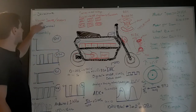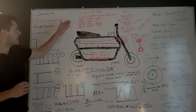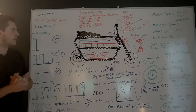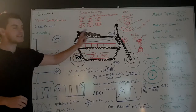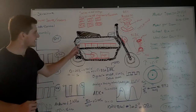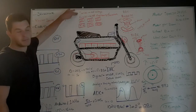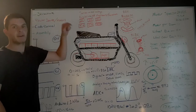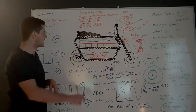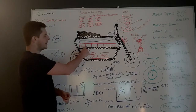Let's move on to the power source and the motors. We did cover this a little bit in previous videos — I walked you through series and parallel and how we set up the batteries to get the voltage we wanted. Just to reiterate: the motors we used were 24 volts, which means they need a 24-volt power supply to run at their full potential. I had six 12-volt batteries. If you connect batteries in series, that means you do plus to minus, plus to minus, and you're adding voltages. So what I did was take three sets of two and put them in series: 12 volts plus 12 volts is 24 volts. That's one battery pack, and we did that two other times.